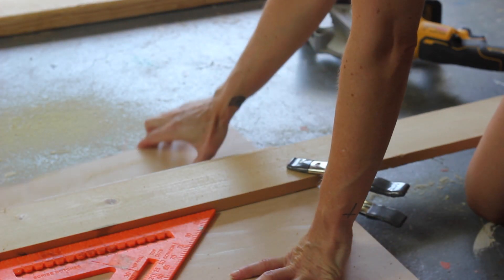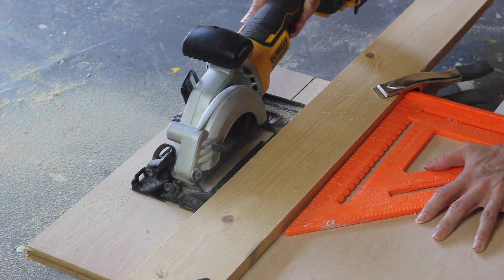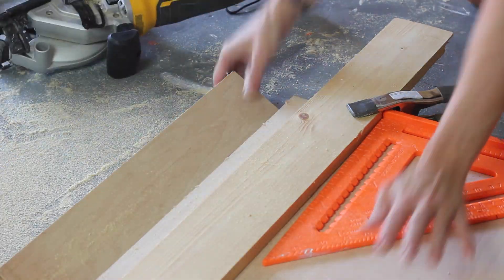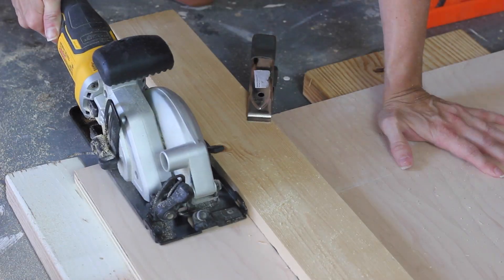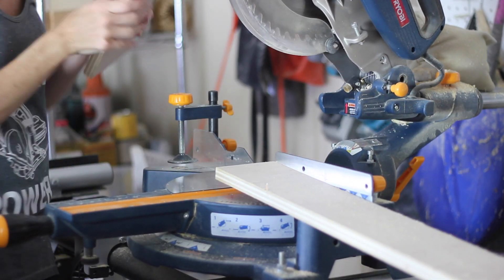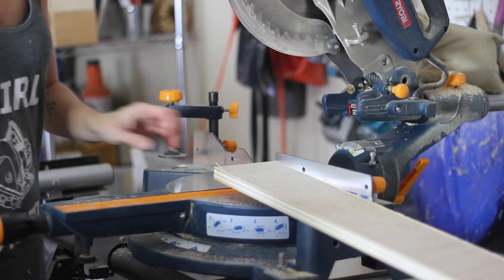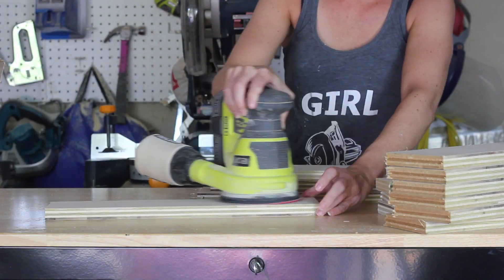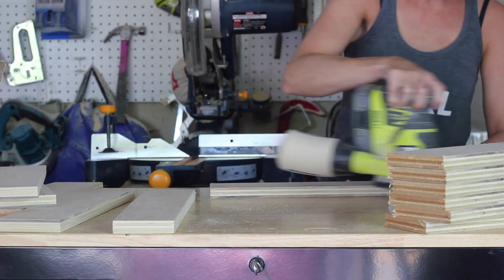You'll also need to cut two pieces at twelve and a half inches by fourteen inches by two and one-eighth of an inch, cut to fit for the bottoms of your magnetic boxes. Four pieces at fourteen inches by four inches — you can adjust the length on these depending on how long you want your magnetic boxes to be. I didn't want mine to be too long since I know my son will pull them out and use them as pencil boxes. Regardless of how long you make them, just make sure you allow space for the magnet in the back. Then cut six pieces at four inches by one inch, which we will laminate to create the front panels on the magnetic boxes. That's a lot of cuts, so I will add the cut list to the description box. Then I gave everything a good sanding using my random orbit sander. I will link to all the tools and supplies I used in the description box below.